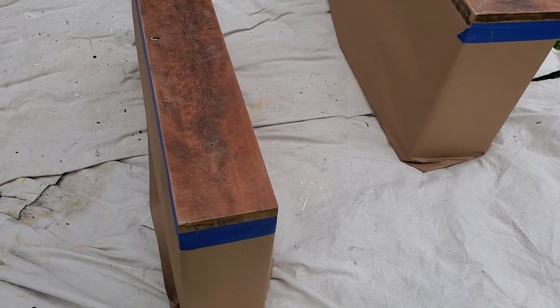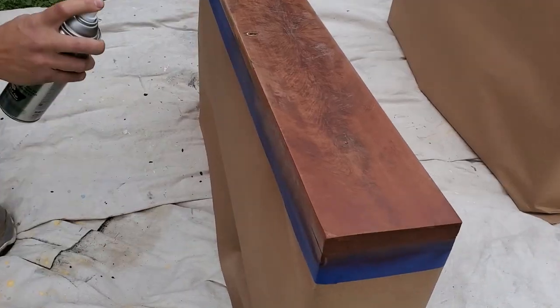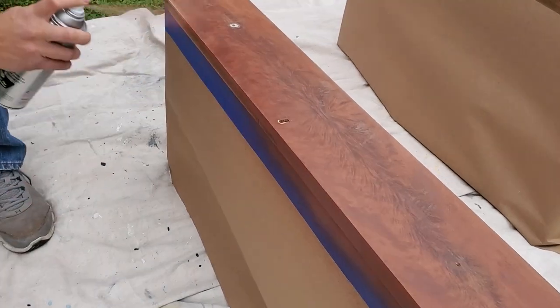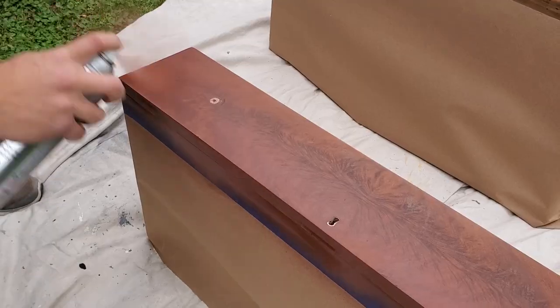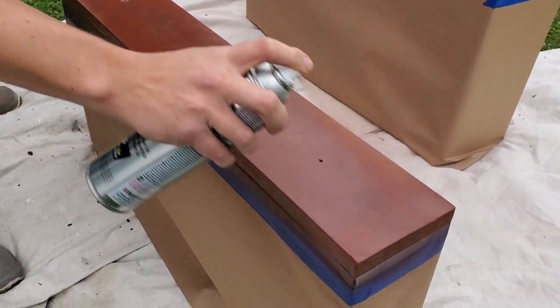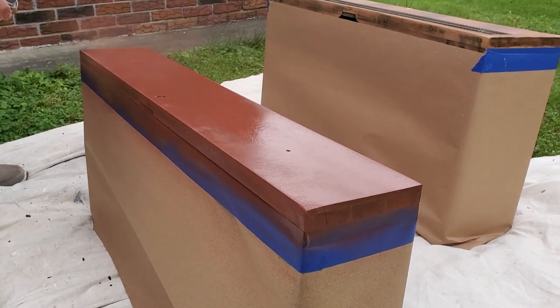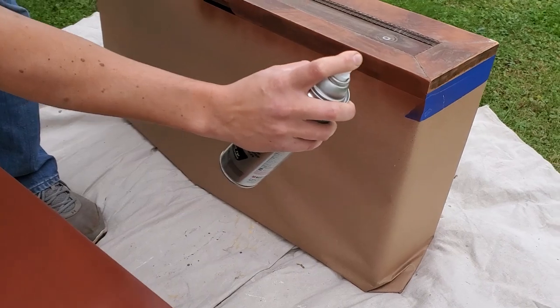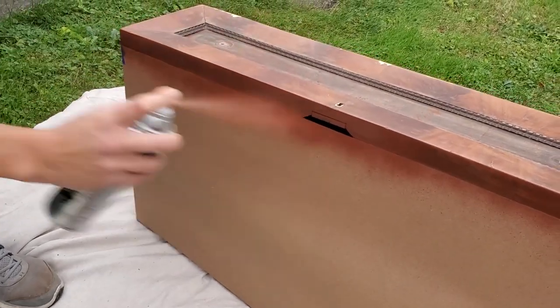And now I am going to prime this entire piece, because it was going to be prone to bleeding. And with those different textures, with the Bondo color and the wood color, it did need a primer. Now, we debated just using a regular brush-on primer, but I had recently seen this tip on the channel Busted to Buff, and he uses a spray primer.